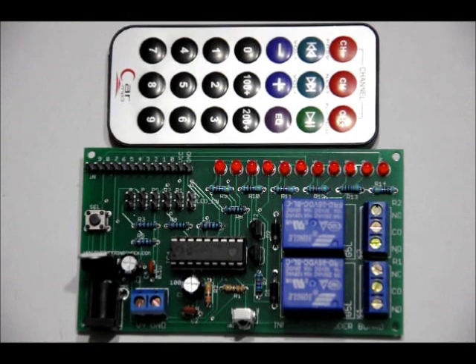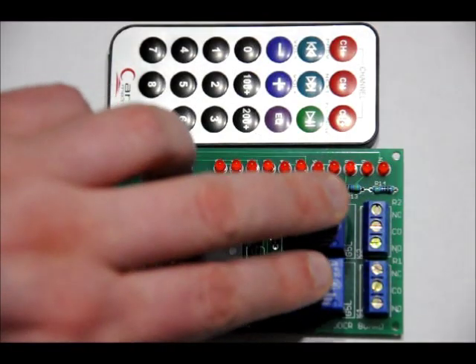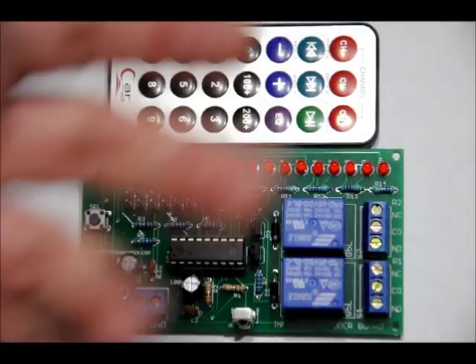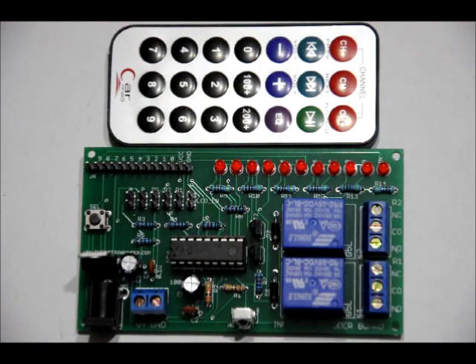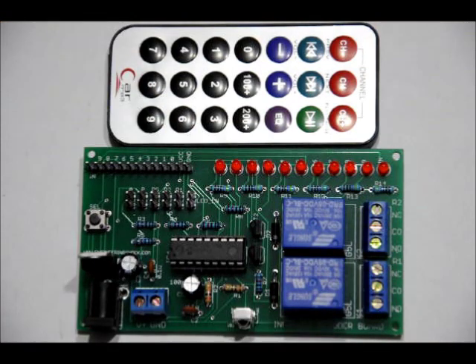This is the Version 1 board. It has all the bells and whistles. The Version 2 board, which we'll talk about later, has the exact same functionality but doesn't have all the bells and whistles. What this little guy offers is two relays, so you can use two of the outputs to control two AC devices, such as two lamps or two motors. You can use DC motors or AC motors. It's essentially two high-powered on-off switches. I'll show you how to use them during a demonstration.